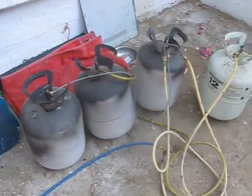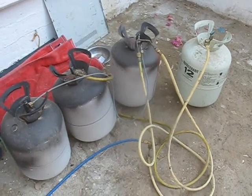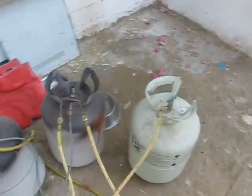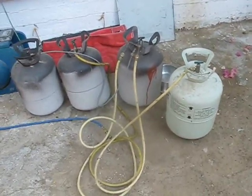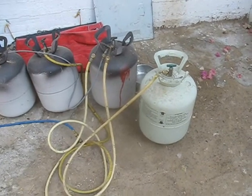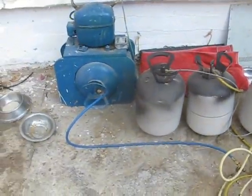So, what these are, well, it's like a scuba diving reservoir bank system. Only we're not talking about high pressure air here, we're talking about 120 psi, which is the normal cutout pressure for a commercial air compressor. Now, this will give me about 5 minutes working time, either spraying or just blowing dust away, cleaning an item, before I need to refill them again. I only have to do this really on Saturdays, which is the Shabbat here, the Sabbath, and tend to keep it quiet.